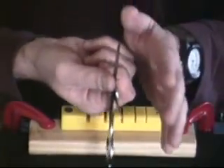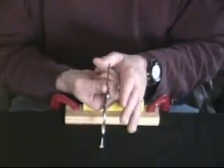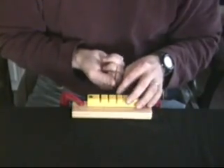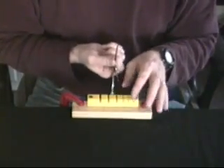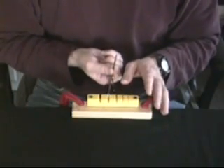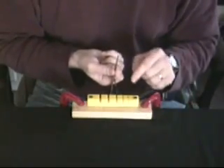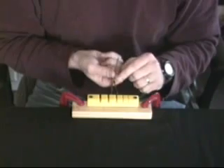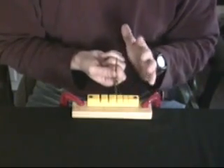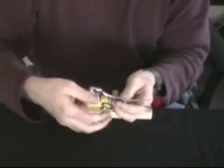The best thing you can do is take a pair of scissors from your starter kit and your set adjusting tool, and deliberately bend the scissor out of set. Knock it backwards, bend the blade away, then test cut with it. If it won't cut, work on bending it back in. Once you've got it back in, bend it back out and do it again — keep doing that until you get a better feel for the set. This does take a little time to learn. If you have any concerns or it's difficult, you'd want to come train with us here at Wolf and we can help.